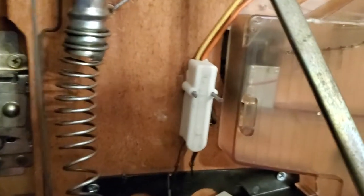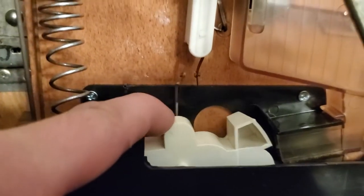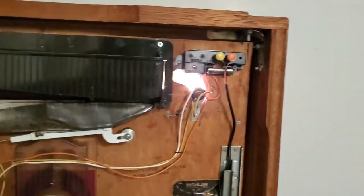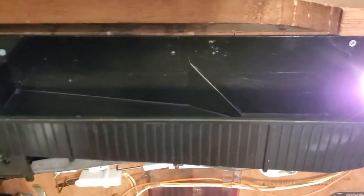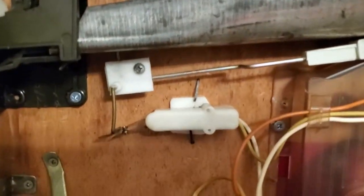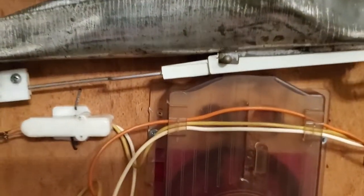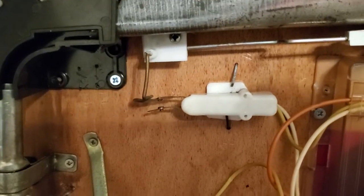The jackpot light is going to be operated by this leaf switch, which basically tilts as the seesaw goes down. I'm not going to force this or I'll break something. And then your ball empty light — if I were to plug this machine in right now, you'll see that that light comes on indicating there are no balls in the hopper. That light is operated by this micro switch, which is attached to this white lever here. When I push this down, which would be pushed down by pachinko balls, you'll see that the light shuts off — those contacts are no longer hitting each other.